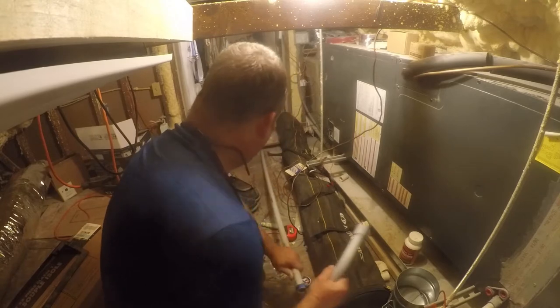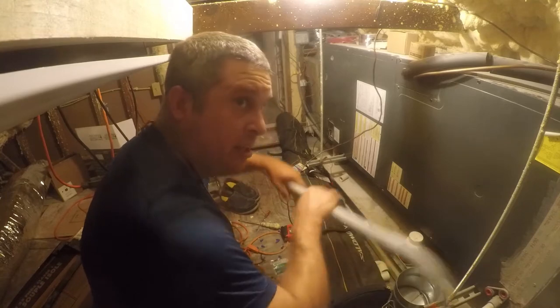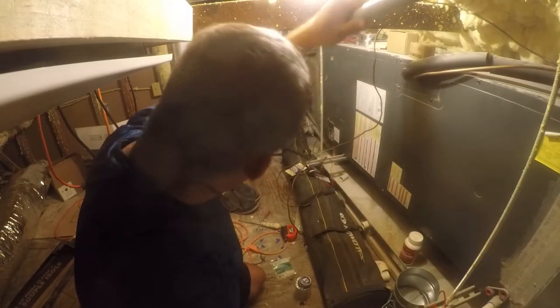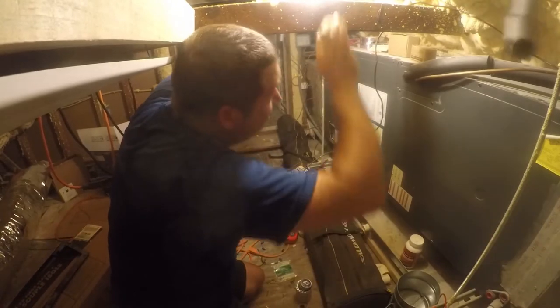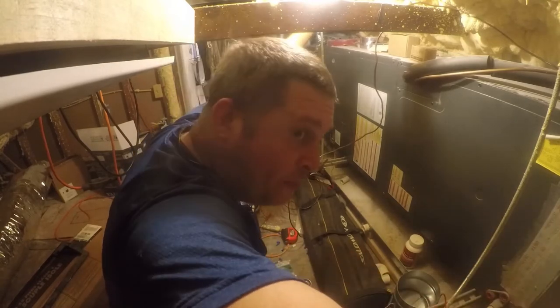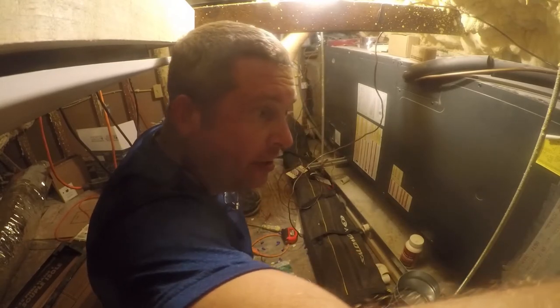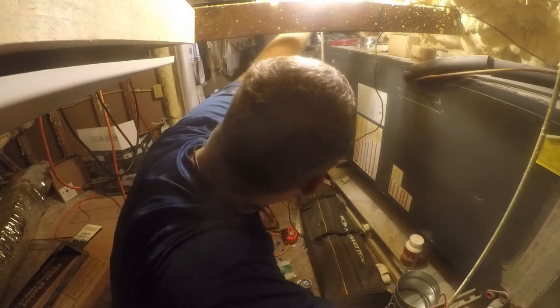You want to pay attention to which way your openings face when you're placing the conduit — it will make your life hell or simple when it comes time to route your wire. And you don't want to go above four 90-degree bends, or you'll be sorry. That's the nicest way I can put it.